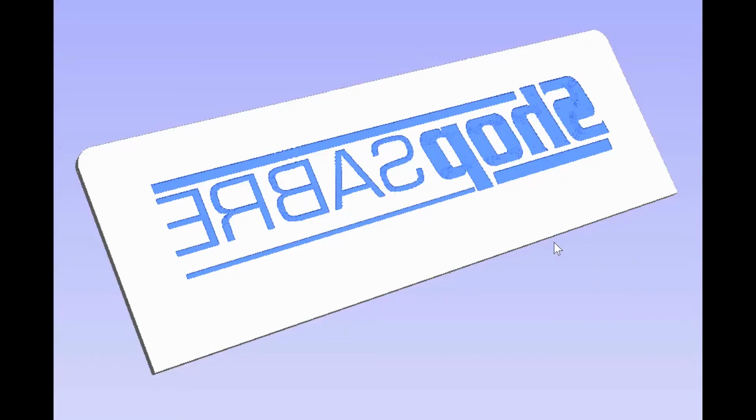This is a piece of acrylic. It's about a half inch thick. The blank was 36 by 12, so it's just a little under that. What we've actually done is we've taken the ShopSabre logo and we've mirrored it. And then we're actually doing a 3D engrave with an engraving tool on the back side. And when the light comes in from underneath, that causes that sign to really illuminate. That's really what makes it neat. Now, once we get that done, then once again, we're going to cut the perimeter of the part out. And that's the machining that's required to do the plastic panel.